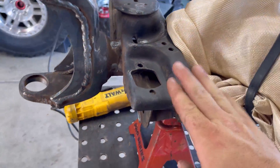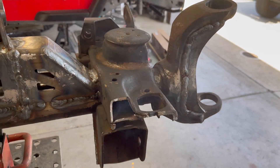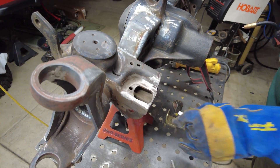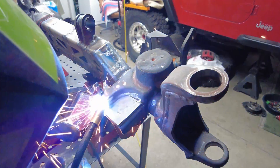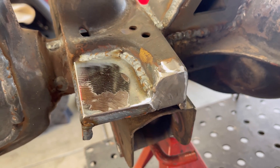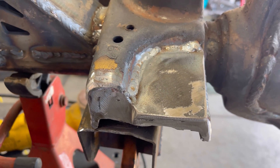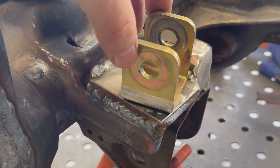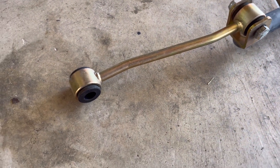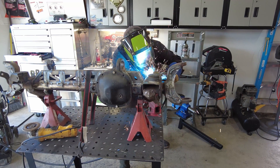The next thing is to cut these off. For this next set of modifications — I feel the advantages are really going to wake this axle up on the trail. We'll get more clearance out of the lower control arms on the droop side as well as more shock extension, and it eliminates the bar pin on the bottom of the shock. We'll beef up the mount with some quarter-inch plating and get it all welded in. I repurposed some sway bar end links from my old lift as the shock bar pin eliminators — it's just a U-shaped bracket that we weld in.